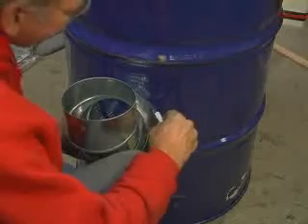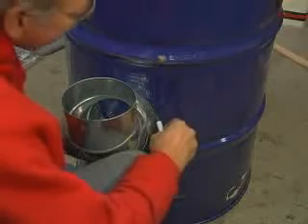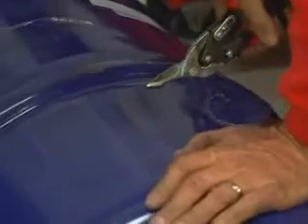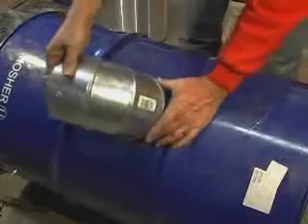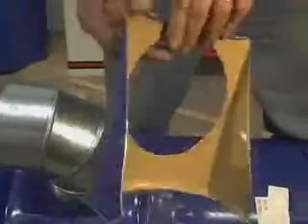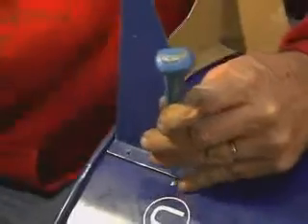With a chimney elbow, trace a circle on the back of the stove opposite the fuel magazine and below the bottom of the skirt assembly. Cut a hole and trim to fit as closely as possible. Craft a chimney brace from the cut-out top of the barrel and secure into place.